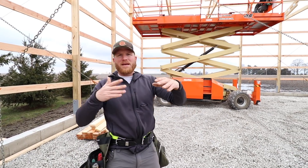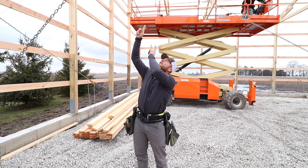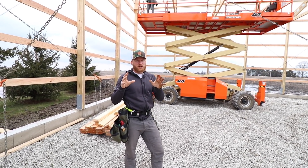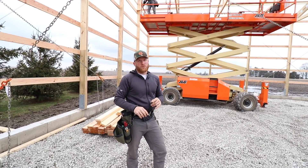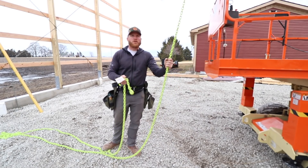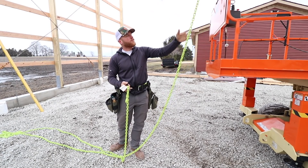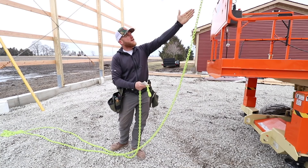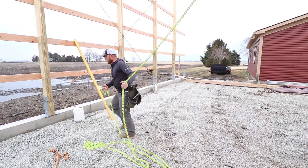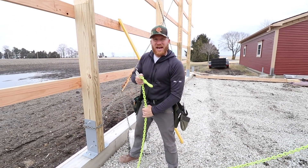You can see how this is starting to come together — we've got X's coming from that third truss back down to the wall, and then coming from the peak back down to the concrete block. This is how we're securing the building; we're not trying to straighten it yet — that comes when we get ready for roofing. Now that the end wall is braced with all our cross chains, we'll do another cross chain about 16 to 24 feet in, depending on the size of the building, bringing a chain from a web of the truss back to the side wall to brace against any wind forces.